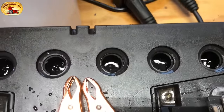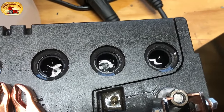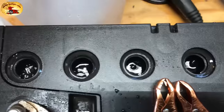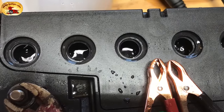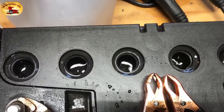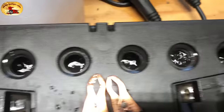If we crank it up a little bit — now it's really going. But we say keep it at the lowest level and you'll be just fine. If you have a battery with a dead cell that will not come back to life, crank it up four or five notches for a couple of minutes to wake it up and get it back to life.